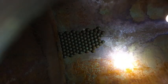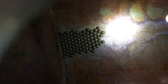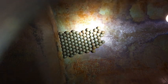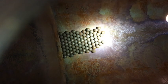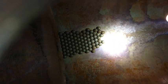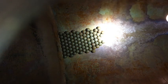Okay, this is day 2. This is after the muriatic acid wash, and it's got flash rust on here. Now you can see the steel 3/4 inch ball bearings I got in there to roll around to loosen up any surface rust. After I get done removing the acids back into their respective bottles, and then fully draining this and then rinsing it with clean water, this is what we have the next day.